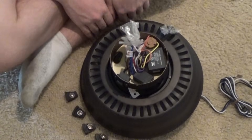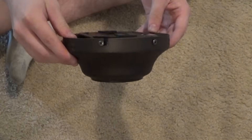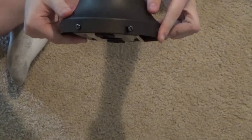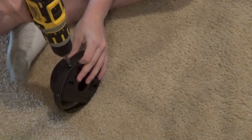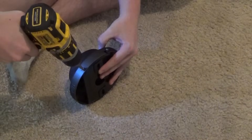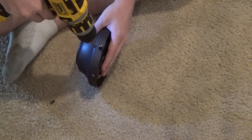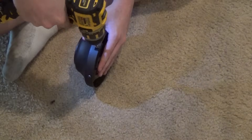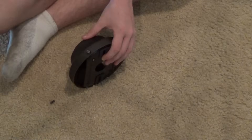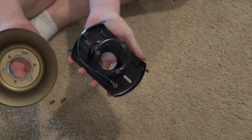Once you get those spacers removed, this is the top canopy — the part that will be flush against the ceiling. You'll notice it has two screws on each side. One of those screws on each side is part of an L-shaped slot — you're just going to loosen that one, not remove it. The other screw you have to remove. Flip it and repeat on the other side. Save these screws because you're going to need them later to attach the canopy. This is just the bracket that holds the fan, and the canopy hides everything so you don't see the bracket and wires on the ceiling.